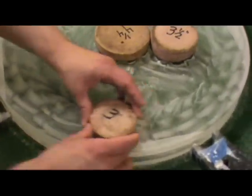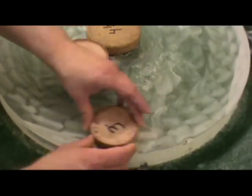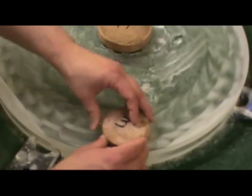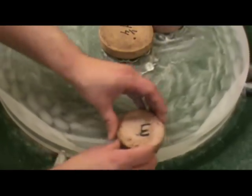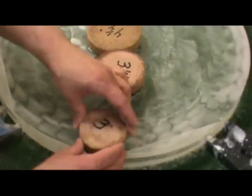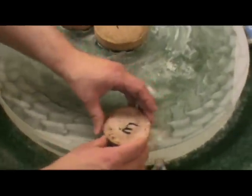So what I'll do is mix it up — I'll do straight strokes for a couple of minutes, watch my timer, and after a couple of minutes when I hit my spot on the mirror, I'll switch over to elliptical strokes. Or sometimes I'll just alternate every other lap: first lap I'll do straight strokes, next lap I'll do elliptical strokes. Again, this helps change the pattern of what you're doing while keeping the correction mostly going into the spot where you want it.